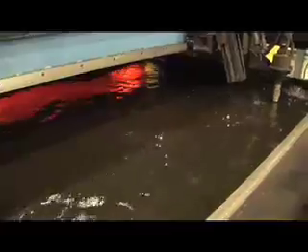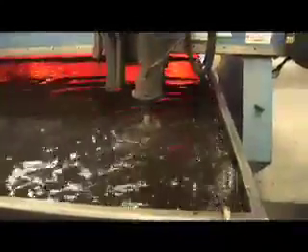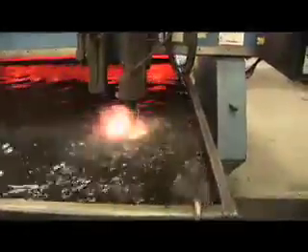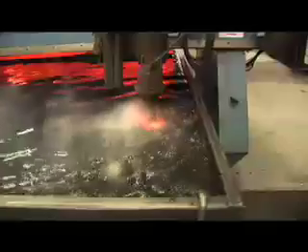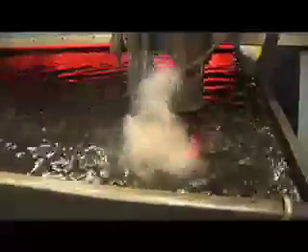Okay, now we're going to start the program. What we have here is a combination of cut water, nitrogen, and electrical current. The cut water is spraying out like a garden hose, removing all the debris from the cut path of the torch head. There's a combination of nitrogen and electrical amp current — as the electrical current makes contact with the plate, the nitrogen is forced under pressure in a straight line. That's what keeps the electrical path in a straight cutting path, forming the straight lines and doing the actual cutting.